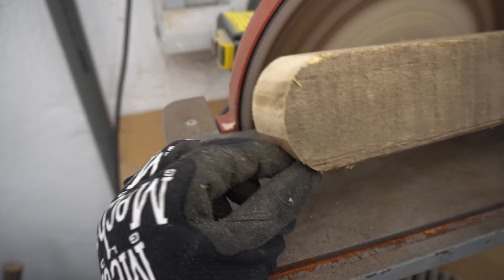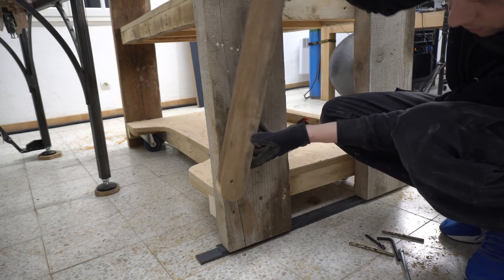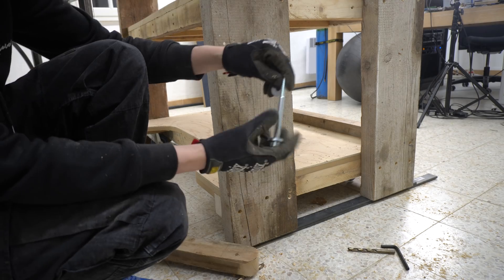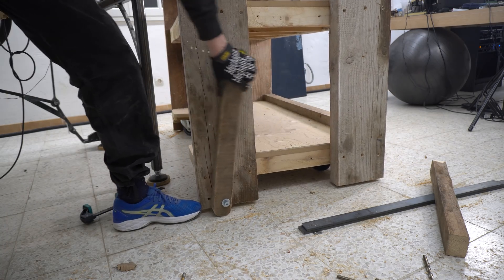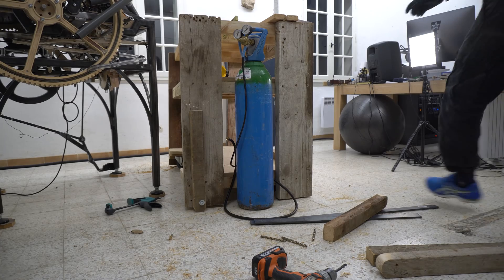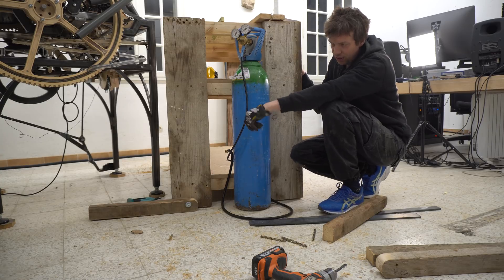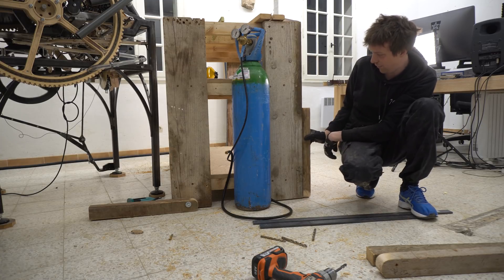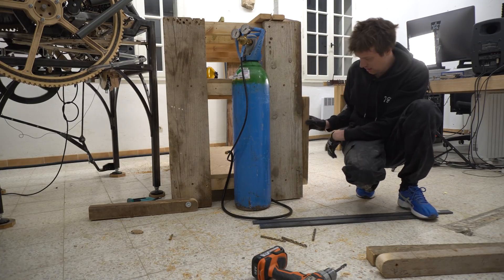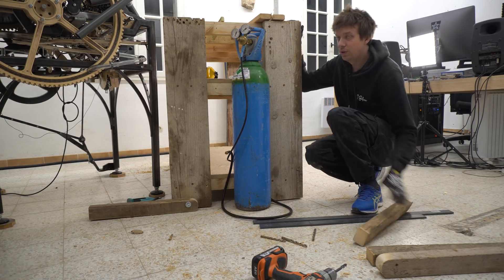Here's my idea: I'm gonna lift the table up — the wheels are now eight millimeter off the ground. Two washers into here. Now we're on the wheels, and now we're on the leg. On the other side of the bench I'm gonna mount the argon bottle, but I don't like to increase the footprint of the whole table when moving it around. New solution — I'm gonna put them here on the front side. This will increase the width of the feet and stabilize in this direction.